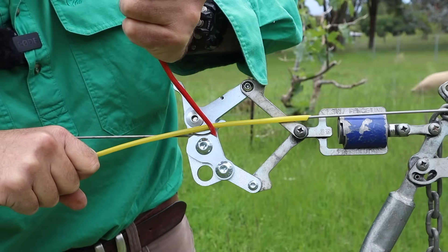And there you have your orange knot. We refer to this as a strainer knot because when it's tied properly, you only lose about a link of tension when you take the strainers off. Let's tie this once again without the colours, then take it up onto the test bench, see how strong it is.